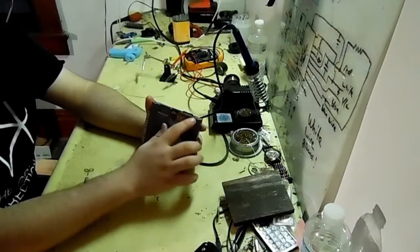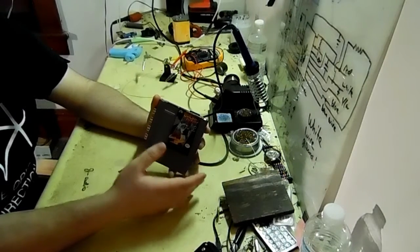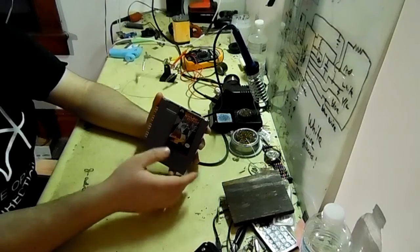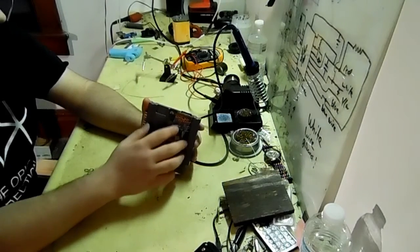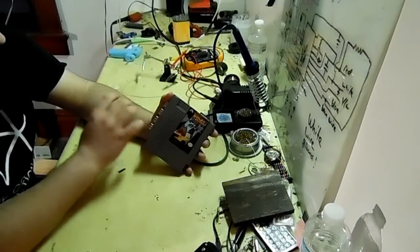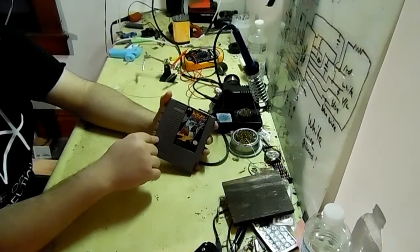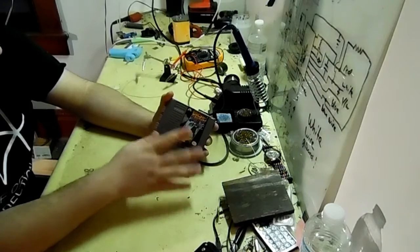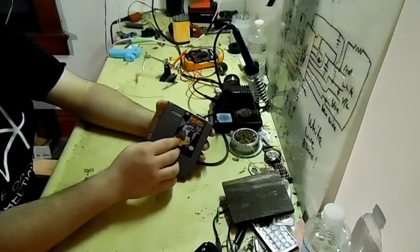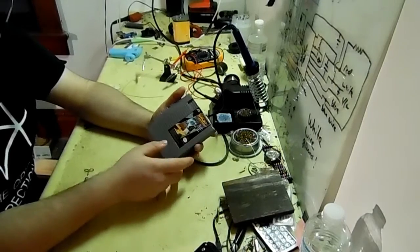Up top you'll notice the SD card. I had to have access to the SD card because it's a nice option — I like having the ability to swap in and out operating systems at my own leisure, and that gives me really nice access to it. Over here to the left you'll notice four USB ports protruding from the case. Despite their appearance, they are female USB ports. This is a four-port USB hub I have on the inside, and I hardwired it to the Pi. I had them protruding so I can have a few more inches of extra space inside the cartridge. I plan to add something else later.